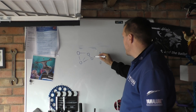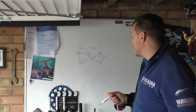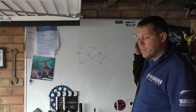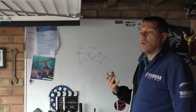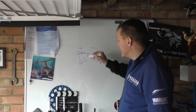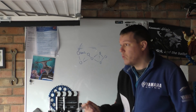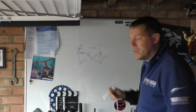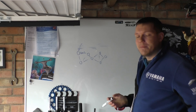Ablation is a bit different. You have all these chemical bonds, and chemical bonds really aren't physically anything — there's not anything there, it's just the interaction between the molecules or atoms themselves. Basically what you do with ablation is pick the correct frequency of energy to cause them to nearly boil — that's the best way to think about it. You're breaking this bond by energising the atoms themselves and giving them enough energy to break free. They get excited, vibrate so much that they can break the hold on them — it's like pulling magnets apart almost.